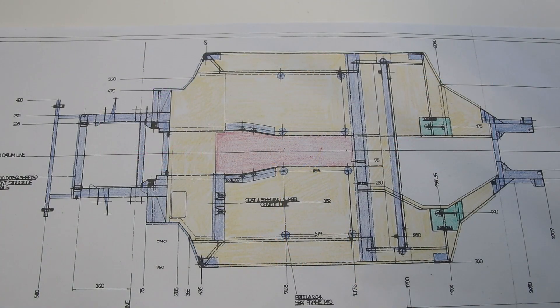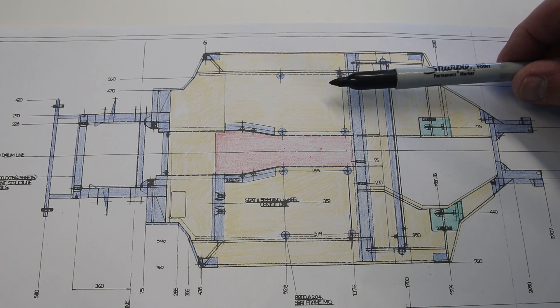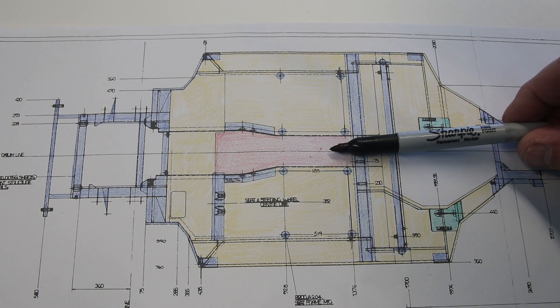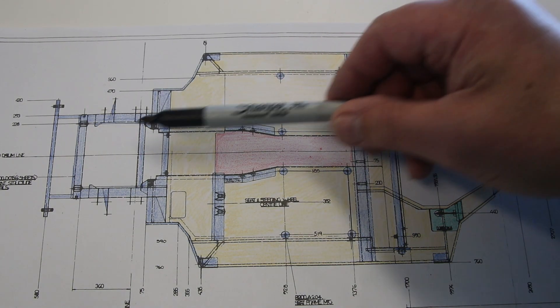Please put any questions in the comments — I'd love to know what everybody thinks, and please hit the like button and subscribe so I know if people are enjoying this. This is the chassis drawing in plan form with colour added to pick out the different materials. Everything in blue is steel, everything in what I called yellow but Emily insists is peach is honeycomb aluminium, red is composite — that's carbon, Kevlar, and mat — and green is the engine mounts, which are cast magnesium.